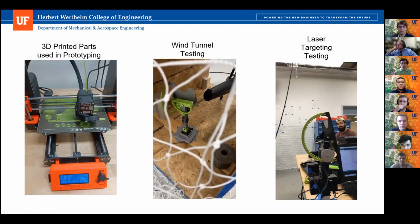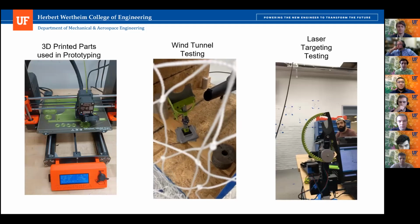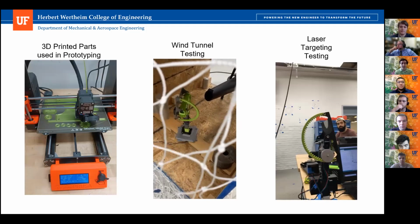These configurations included the safe mode, which had the mirror parallel to the ground to present a low surface area to the wind. And then we also had the angle which presented the most surface area to the wind, as sort of a worst case scenario to endure the greatest amount of force. The testing apparatus also rotated the heliostat to ensure that all possible angles were tested.